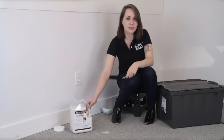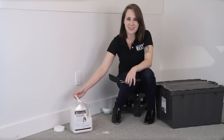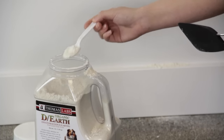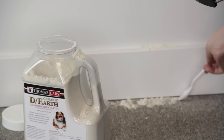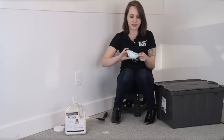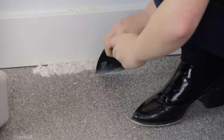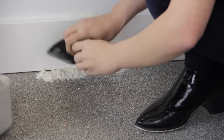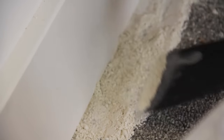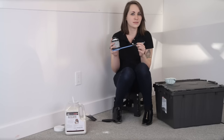This is a really simple process and no real tools are required — just some kind of spatula or flat-edged object to push diatomaceous earth into the crack. I've got my bucket of diatomaceous earth here and I'm just going to use a little plastic spoon to scoop some out and place it along the crack. You can use anything to scoop — measuring cups, whatever is easy for you. The only thing that's important is getting enough down. Now I'm just going to use the spatula to push the dust back into the crack — it's that easy. If the crack's wide enough, you can also use a duster like we did in the outlet to push diatomaceous earth deep into the crevice.